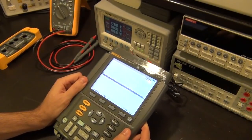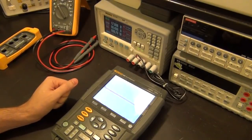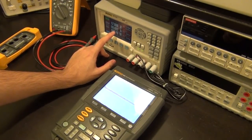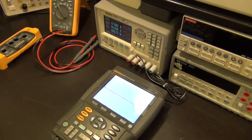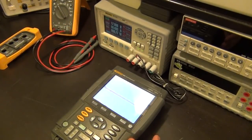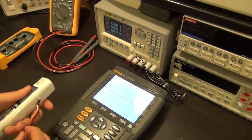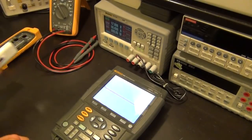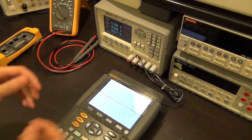I don't know if I'm disappointed or happy about that, because if it has a fault, then it will be much harder to fix. But when it does power on, it's taking about 500 milliamps, 8.8 watts from 17.8 volts. The other possibility is that it powers on AC, and they never tested that, and it doesn't power on from a battery. That could be a problem. Maybe the battery part is broken, but the AC part works, or maybe it doesn't charge the battery. So we'll have to test that. But now that it's powered on, I'm eager to find out if it can actually display a signal.